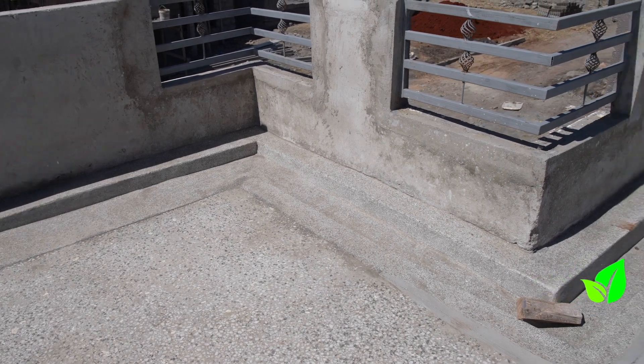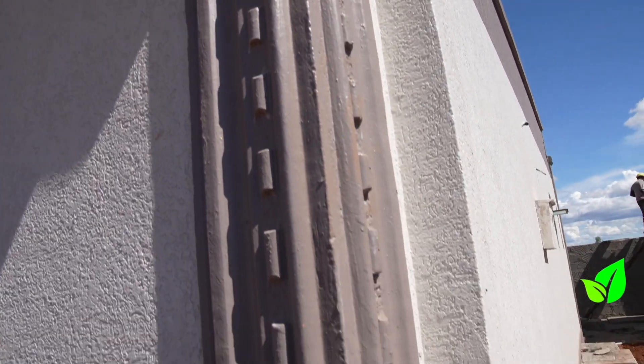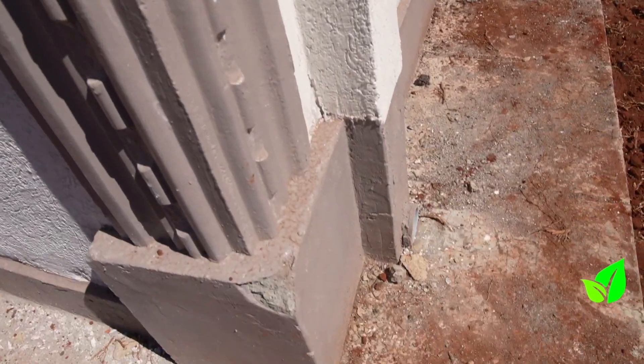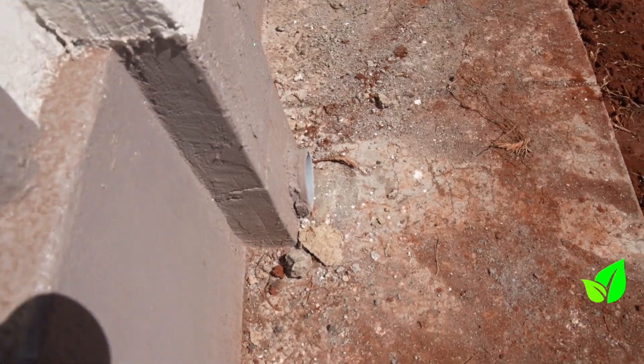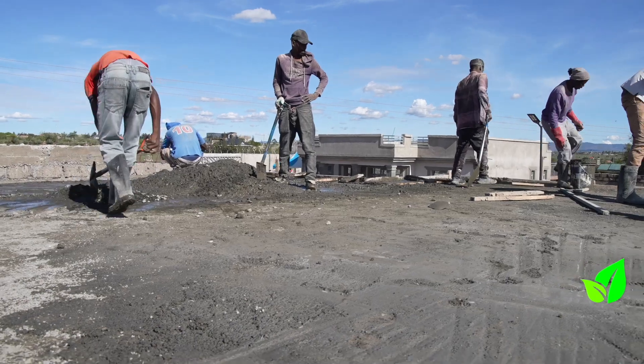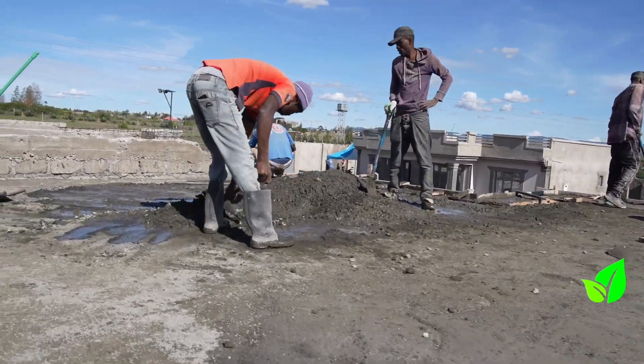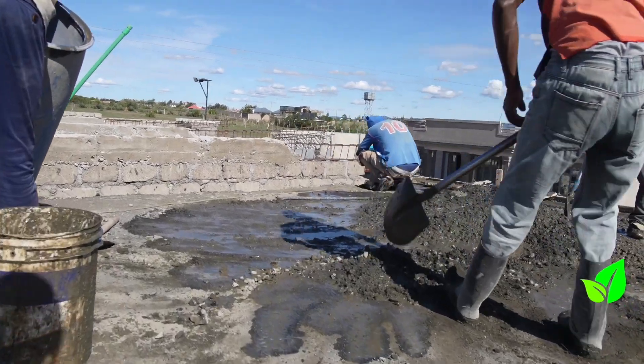The slight slope in the roof means the water will flow into the internal gutter, which goes around the inside edge of the roof and drains the outpouring of water through the inner roof drain. For this project, they have opted for a waterproofing cement mixed with a 100mm screed laid on top of the Beam and Block slab.